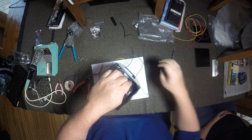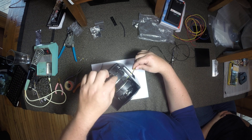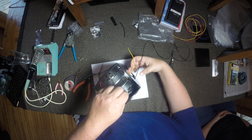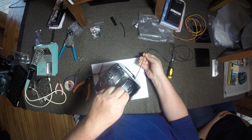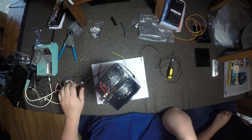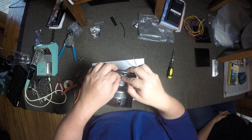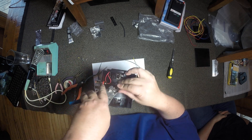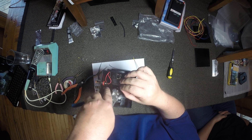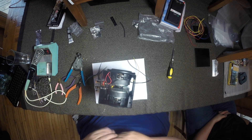One ground wire to go to all the drivers. I'm going to pull it through the front, grab my yellow wire and pretty much just match up the length over here. Give myself a little extra slack and come down — I know I've got enough wire to get to the ribbon. I'm going to cut this off because it's already way too long. Now we strip the wire and make a little bit of a notch in there so that I can connect my terminals to it. Be careful you don't yank on it too hard because if you do, it'll just break the wire loose. Make a nice little connection and we're going to solder that up real quick, then jump over to the other side.